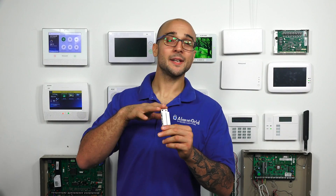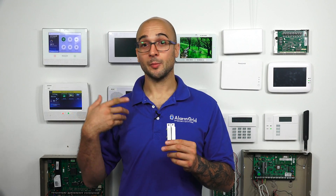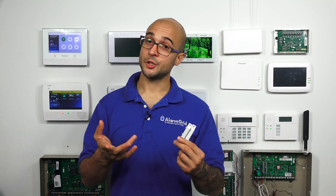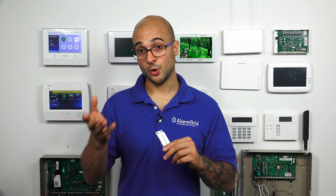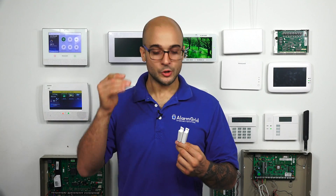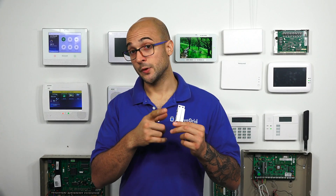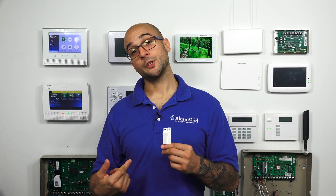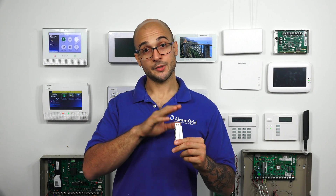As a final point of why the contact could stop working: perhaps something in programming on the panel changed. If you went into your panel and accidentally edited the contact programming, there's a chance it's not going to work anymore, which would make you think the contact is broken when it's really just a programming issue. If you're managing the system yourself, check your installer guide and go through the programming steps to verify the fields for the contacts are set up correctly. If you have your system monitored by an alarm company, you could call them and ask them to confirm that your contact programming is correct.